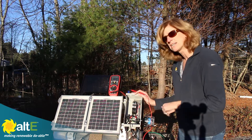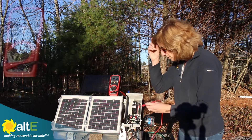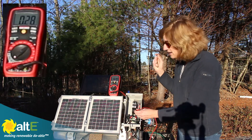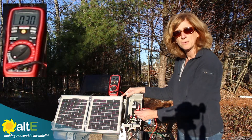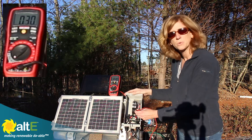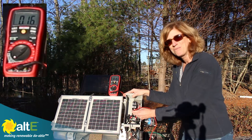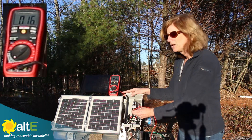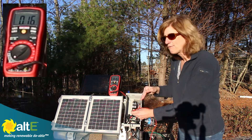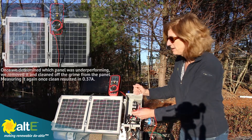Because I've got the system disconnected and I have breakers, I can turn them off individually. I'm going to measure the input of breaker one. From solar panel 2, I'm getting 0.3 amps — that's what I'd expect. From solar panel 1, I'm getting 0.16 amps. Something's wrong with that solar panel. By isolating each panel through the breakers, I'm able to detect exactly where my problem is.